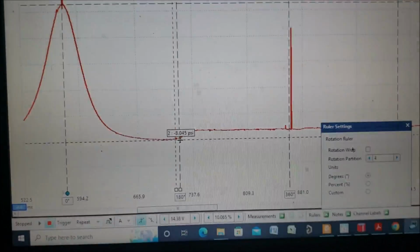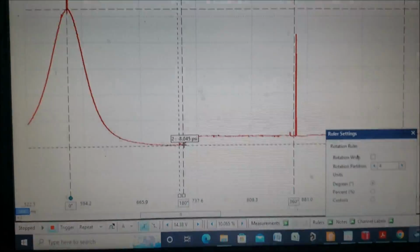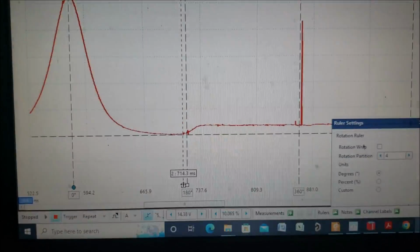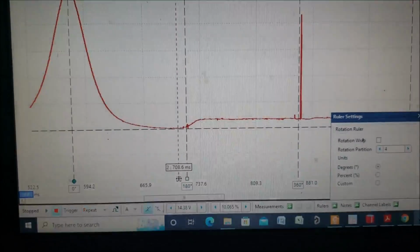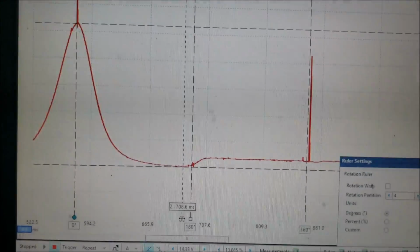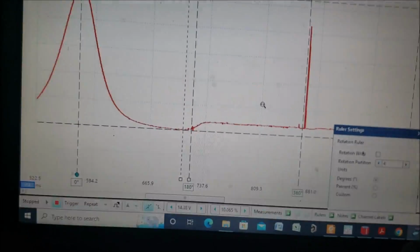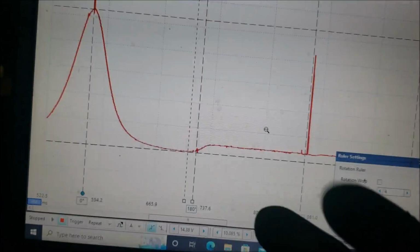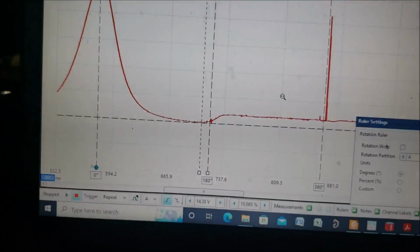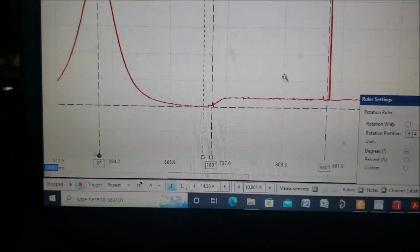You see where the 180 degrees is at, and from the change in pressure is where we assume that the exhaust valve opened. Right now that's at just 13 degrees before bottom dead center. Now this is cranking. Normally with cranking, the 180 I would see on this end, right here, after the hump rose to about atmospheric.